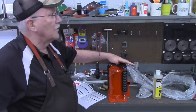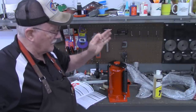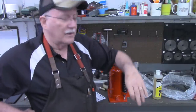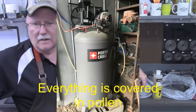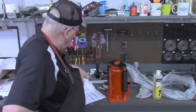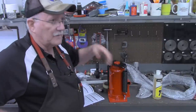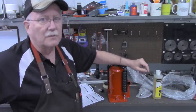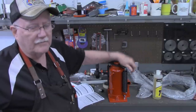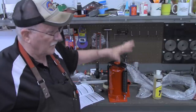My tank pressure here at the Tin Barn is 150 PSI, and I've got it regulated to 125 PSI at the dryer and filter. I always turn the compressor off at night — I've got a couple of hoses with some leaks, and I think there might be a casual leak in the Rapid Air system too. So I just flip the breaker next to my light switch. If I remember, I also shut the valve off at the tank to save the compressed air since it does leak down some. I know I've got one hose with a pretty severe leak in it.